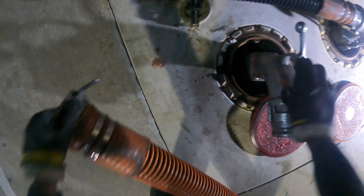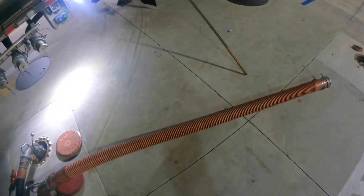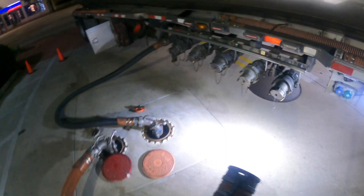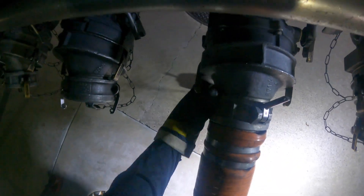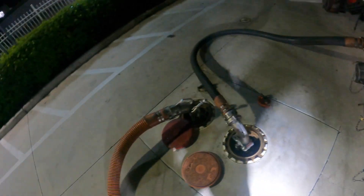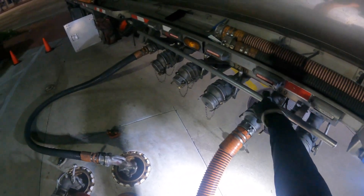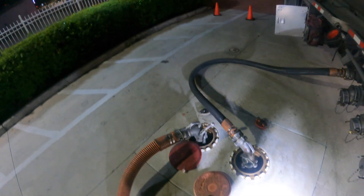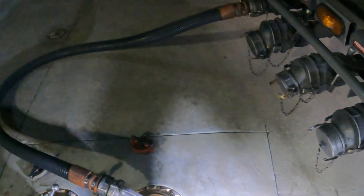For this hose, it ain't too much hose on the ground. I don't like to have too much hose on the ground - that way the fuel will take longer to drop. Put that hose down. It's my 1450 compartment. Red top by the tank means it's premium. Another way to verify is to look at your paperwork and make sure that's what you have in that compartment. Compartment 2, I have premium - 1450 gallons.